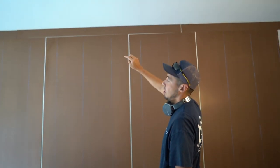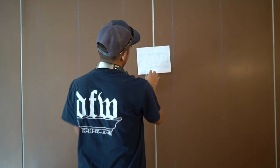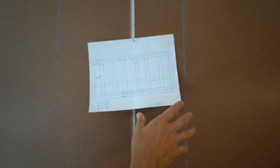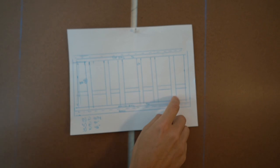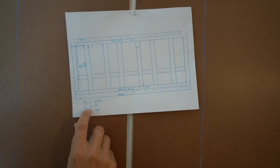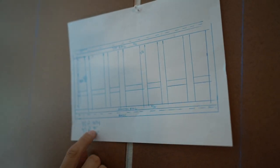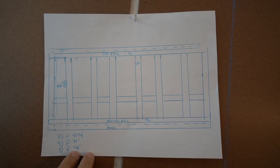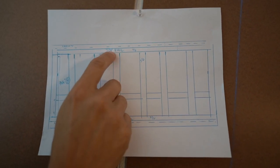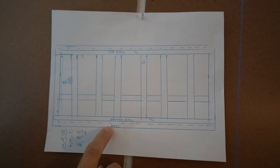We did the same thing up here for the top rail. I have this sketch right here that we just sketched out — it's a rough drawing, the measurements are exact but obviously it's not to scale. We're going to need eight vertical stiles at 90 and a quarter. Then four horizontal rails on the small ones at 30 inches, and three of the wider paneled mid-rails at 46 inches. The top rail is 302 inches — that's going to be a seam. The bottom rail is the same, 302 inches, also a seam.